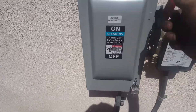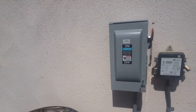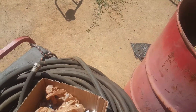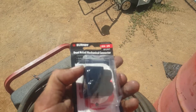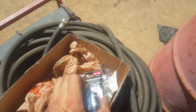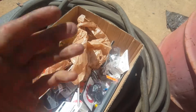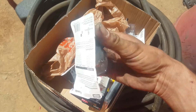Just like that we're up and running. It takes a little time to change it out. Like I said, the wires were a little short, so I did have to lengthen them with the insulated splice connectors. I bought an extra one — let me show you what they look like; this one's still in the package. They're a little pricey — about almost 20 bucks a piece at Home Depot. They do make wire nuts for six-gauge wire, but these splices are great.